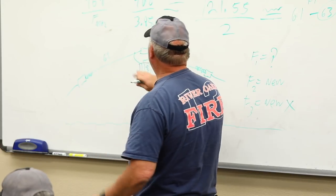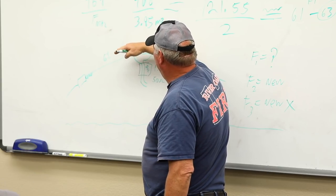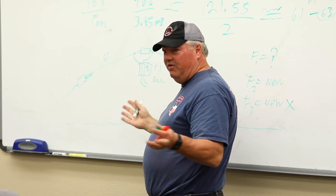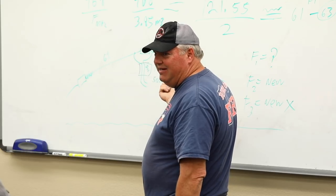So, we're not going to talk about balance. You already know if it's flat, it's around 70, 72 ohms. We inverted the V, and it gets closer to 50 ohms. Now, keep in mind these are all approximate values, because if you stick a meter on there, everybody's antenna is going to be a teeny bit different.